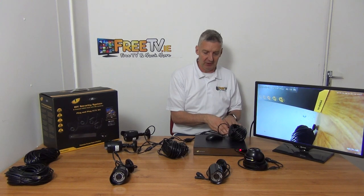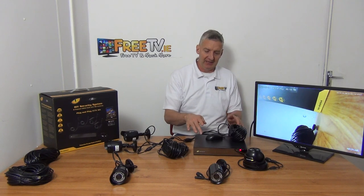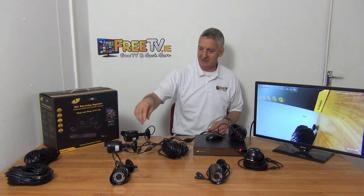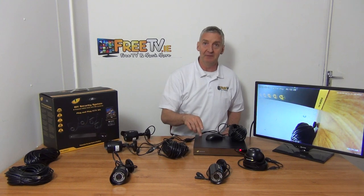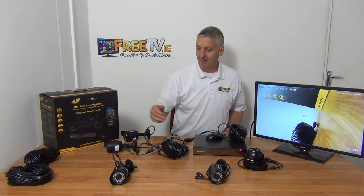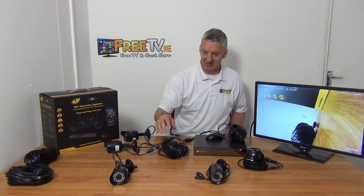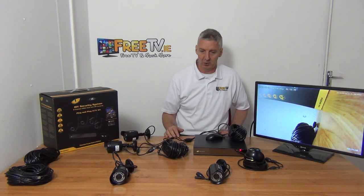The power unit that comes on this unit is totally over-specced. The reason is it's powering the NVR, it can power a hard drive that's inside, and it's also powering the four PoE ports. So in each of these cameras, you have the option of powering the camera locally, but you don't need to because the NVR is capable of doing it. You should use the cables that we give you — don't use low-quality cables. This is Cat6 cable with an extremely high copper content. We tried it on lots of other cables and it did not work well, even over short runs, so use the quality cable that comes with the kit.